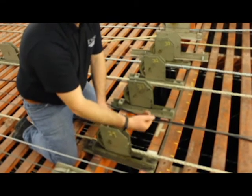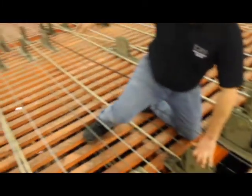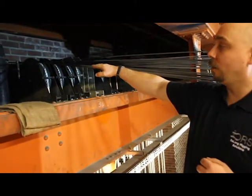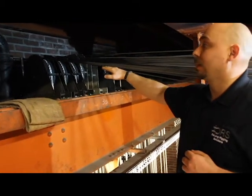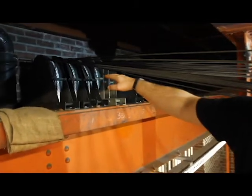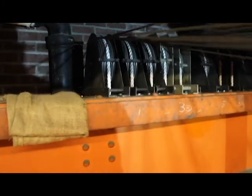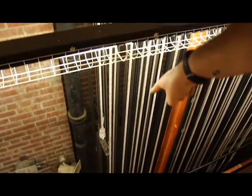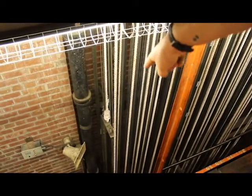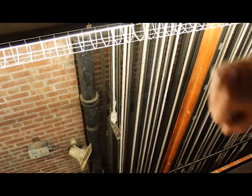Your cable — your load line — is going to come through the loft block, and then it's going to head to the head block. Once our load line comes through the loft block, it's going to come over here to the head block. All the lift lines for a batten are going to end up going through the same head block. Notice that also your purchase line goes through the same head block. All of these lines and your purchase line go over the block and down to the top of the arbor where it terminates. It should be noted that on those shackles where it terminates, there should be some mousing wires.